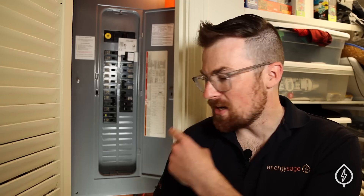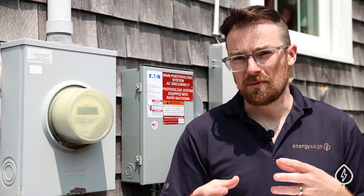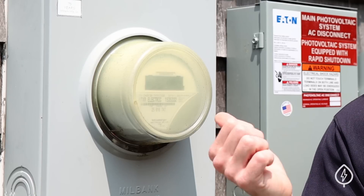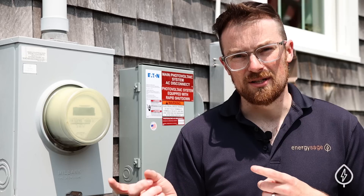Because there are empty slots at the bottom of this main electrical panel, this homeowner has more than enough space and capacity on their main panel to support going solar. Now that the physical work of the solar install is complete, the last step before this solar panel installation can be turned on is for it to pass both city and utility inspections. This process can take anywhere from a couple of weeks to a couple of months, depending on how busy everyone is. Once the utility signs off, they'll come out and either reprogram your existing electric meter or replace it with a new smart meter that can capture both how much electricity you're pulling from the grid and how much you send to the grid when your solar panels are producing more than you're using on site.